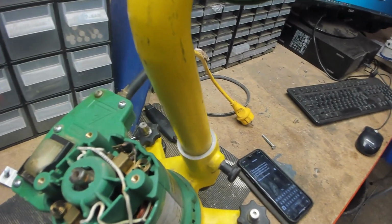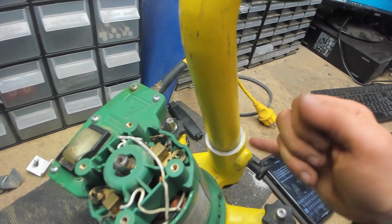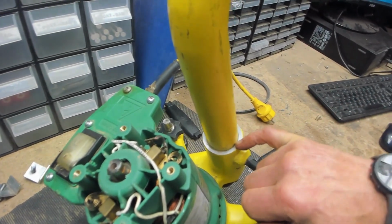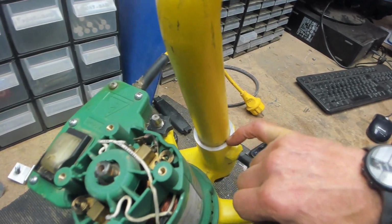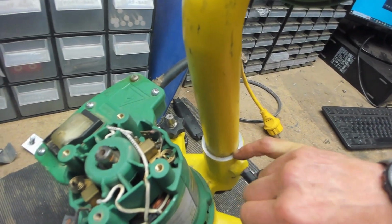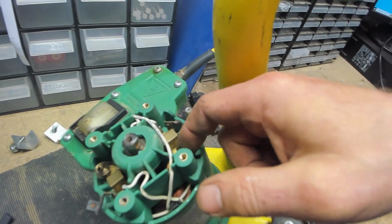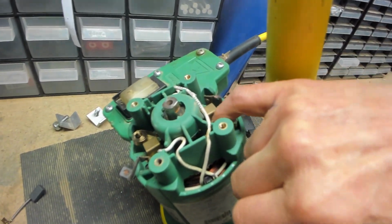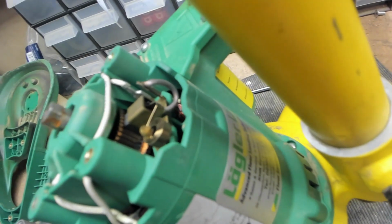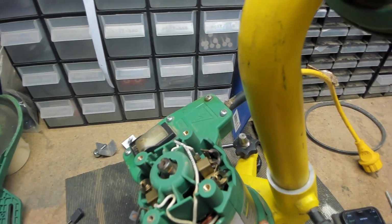Typically the two symptoms that you may have noticed that arise from this, you'll get occasional spits of dust coming out of the side, the gap. Now this can go in your face and you'll notice that. Our technicians have noticed it on theirs, but worse than that, the dust that comes out of this gap can end up getting sucked into this area of the motor, onto the commutator, in between the brushes, and it wrecks that commutator. Now when that happens, you have to have the motor rewound, which is over 400 quid.